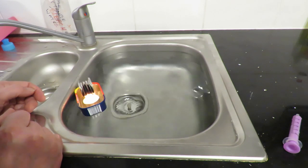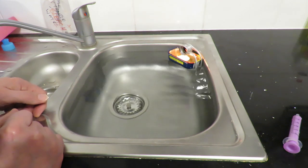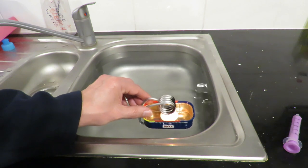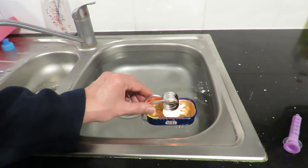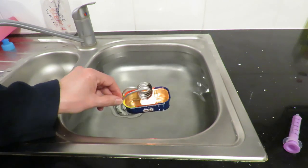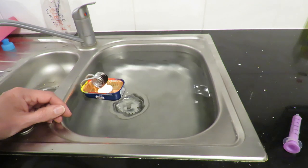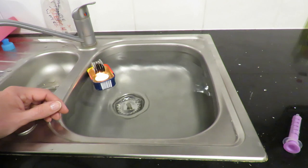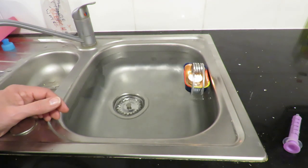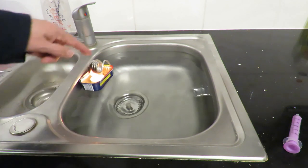So that should answer another one of those questions. How hot do they get? Obviously it's hot there, that's where the flame is. But the rest of it is relatively cold, because that's how it works. There you go, I'm not being brave or butch or anything. It's warm, but it's not burning my fingers. It will do if it gets really hot, because then the steam gets further down the pipes before it condenses. There's so much motion going on with that one, isn't there? I'm not advising you to get hold of the pipes, I'm just demonstrating, because you may well find the hot bit.